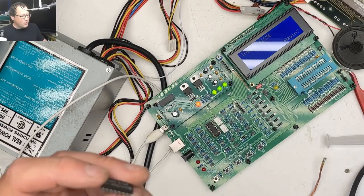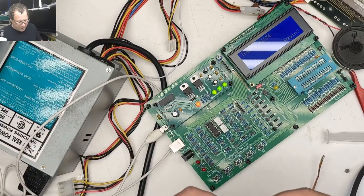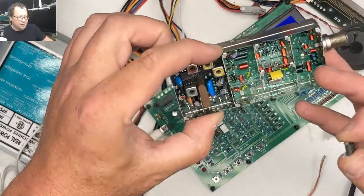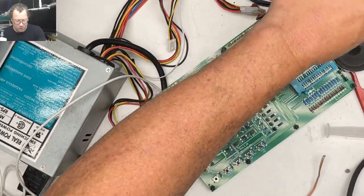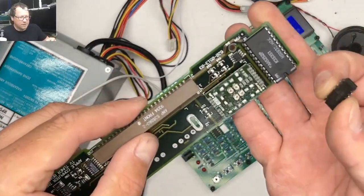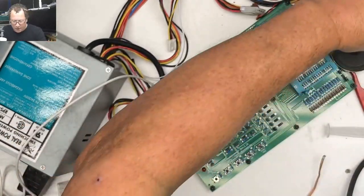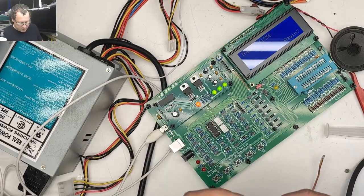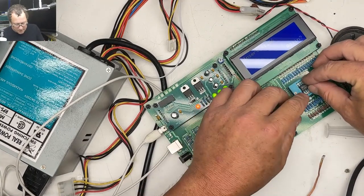So we put all the chips back on the board, and it booted right the heck up. So the Mac TV is good. I still need to recap the TV tuner part of it, because there are multiple parts of the TV tuner that has caps. There were a bunch over here that were all leaky. So that needs to be recapped. I need to order the caps for that still. So someday we'll get to play our Atari 2600 on this thing.